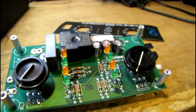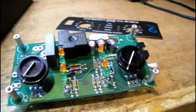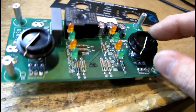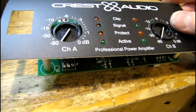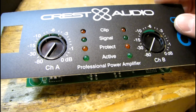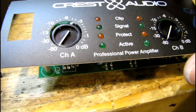The downside is if you need to do any servicing or if your knobs get broken, anything like that, you've got to waste your decal and pull the board out, do the work, and put it back in with a new decal. And since it's outside the amp and you can't really tell what position your controls are in, you have to have a new decal for that too, and lay it over the control panel and make sure you've got the knobs in the proper position on each potentiometer shaft. They have to track evenly in each direction, be even with each other, and also match up with the markings on the decal.